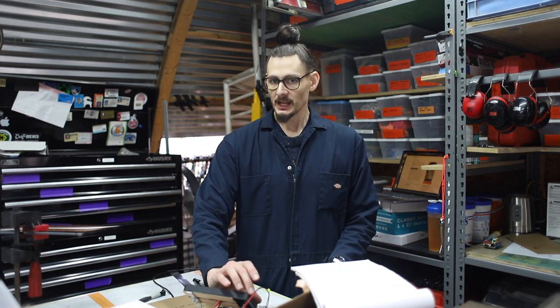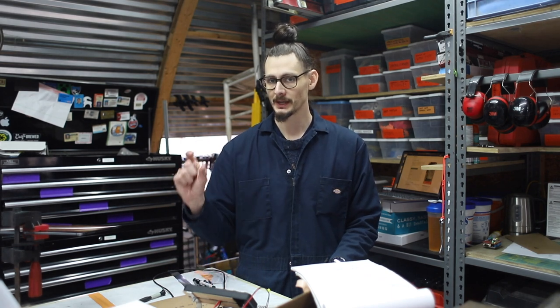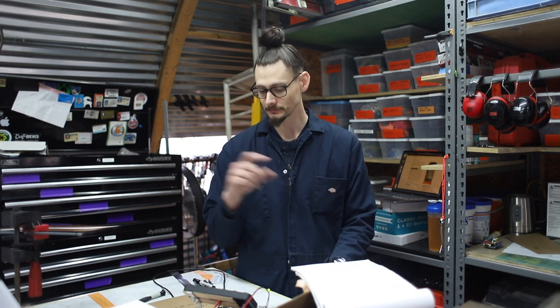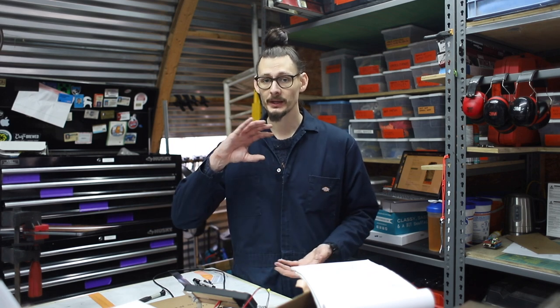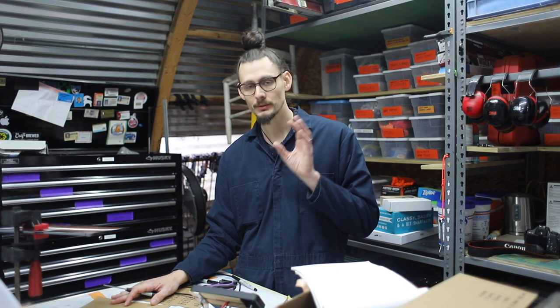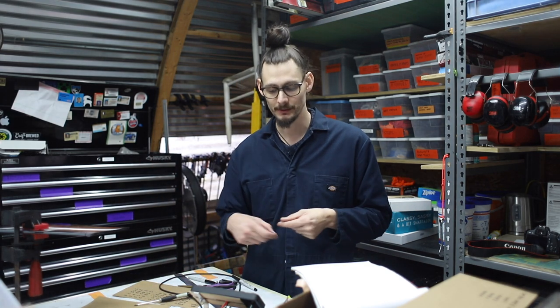These LEDs are individually assigned to a binary spot in the message payload that is then encoded in hexadecimal values for the purposes of transmitting over the wire. So if we have that in mind, we can take a look at the API, reverse engineer it, and make it do exactly what we want. This controller has 12 buttons. We have to transfer data over the wire somehow to address these 12 buttons. The manufacturer publishes an API that describes how these buttons work.